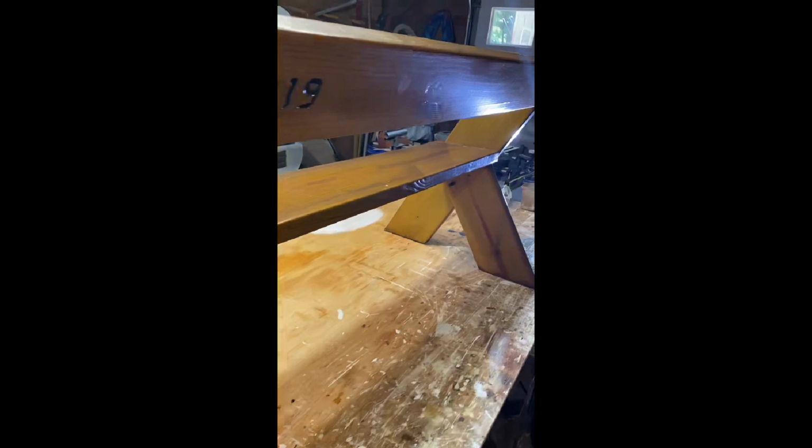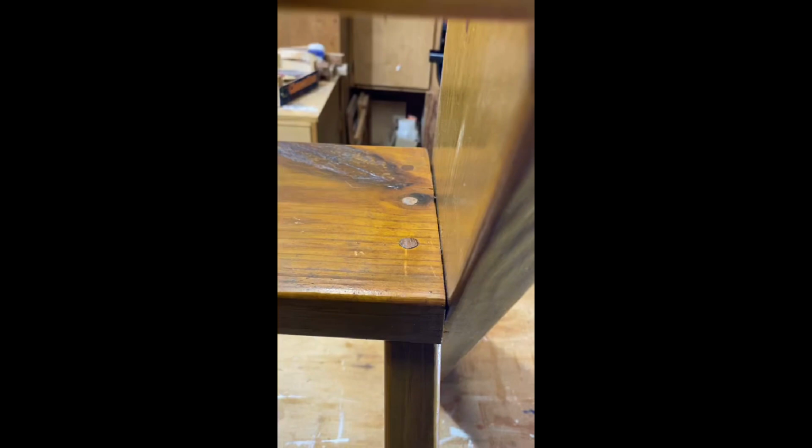You can upgrade an ordinary Leopold bench and make it into an elegant Leopold bench. First off, I enclose all the fastener holes that are in the legs, the backrest, and the seat with black walnut dowels. Also cut a notch in the leg for the backrest support. And I also pour an epoxy foot on each of the legs to prevent wood rot.